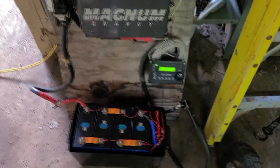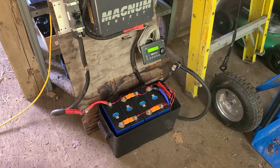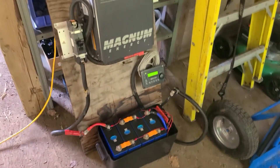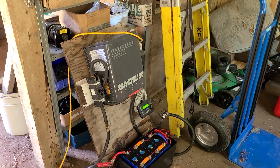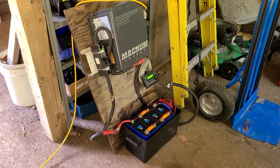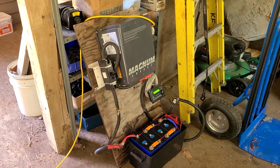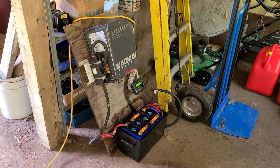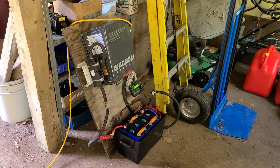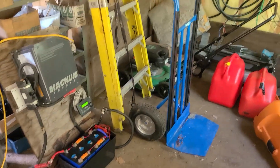So there you have it. For my limited testing here, these DALI 250-amp 12-volt BMSs can definitely handle surge currents — we'll have to look at what the video shows in slow motion, but I think I saw over 300 and maybe over 400 amps at times. Maybe I'll continue this test some other time with an actual clamp meter to measure the maximum inrush current. But for now, that's a good enough test for me. I'm going to start using it as a portable power station, hooked up to this little hand truck.